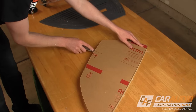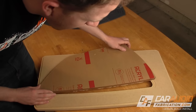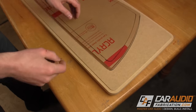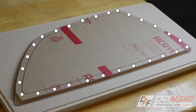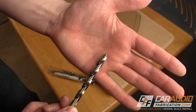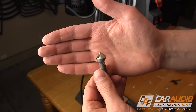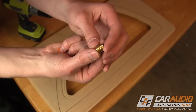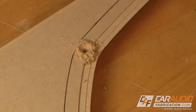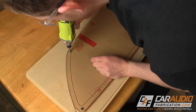The shaping is absolutely not required, but if you are working on a complicated subwoofer enclosure, you might have to do this process. Now let's move on to getting the acrylic mounted to the backside of the subwoofer box wall. I start with using a center punch to mark drill locations for my fasteners. I'm doing this just in the corners on my project, but if you were actually doing this in a subwoofer box, you would want fasteners every two to three inches. For drilling the holes, we want to use special acrylic drilling bits — the link is down in the video description. To make sure my holes are perfect, I'm using a drill press, but you could also use a hand drill and a steady hand. After drilling my holes, I'm using a countersink bit, which makes an angled cut and allows me to countersink fasteners that sit flush down into the acrylic. Next, I need to mount threaded inserts into the wood. These threaded inserts add a metal thread to the wood so we can take the window on and off without ruining the threaded holes. Once all of the threaded inserts are added, we can test-bolt the window into position.